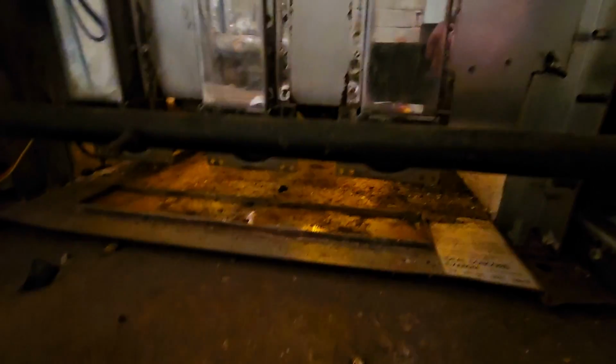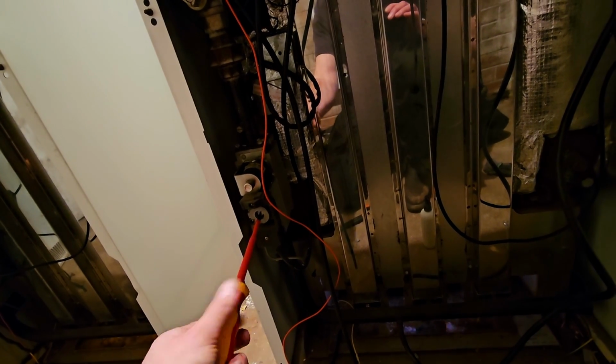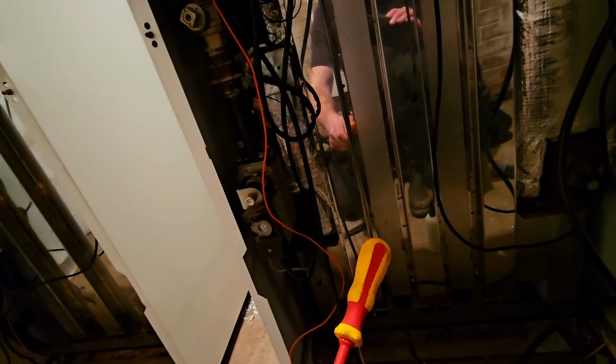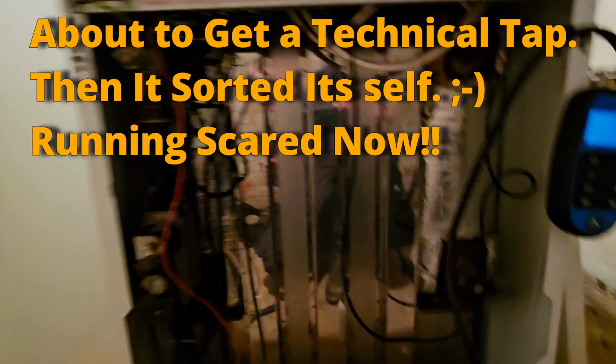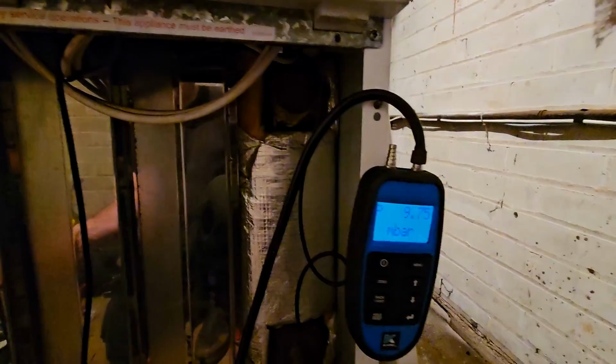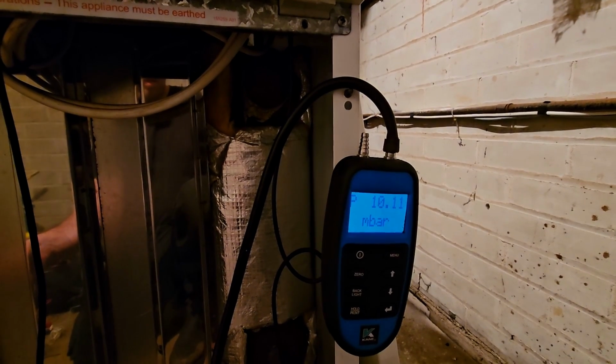So here we go. That boiler's running. And that boiler's running. That's just starting to get bluer. The flame, that is. Burner pressure's too high. Burner pressure's a millibar a bit higher than it should be. Okay. Maybe this valve's sticking a wee bit. Oh. Yeah, that's exactly what's going on. It's unstuck now though. The valve was stuck. Just tweak it, get it right. About 10.2.